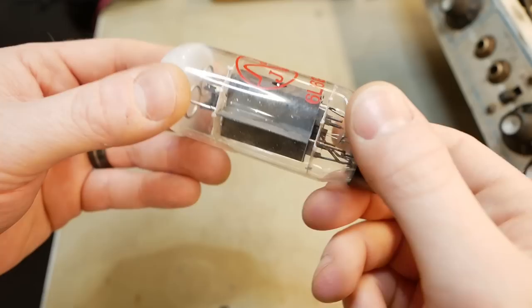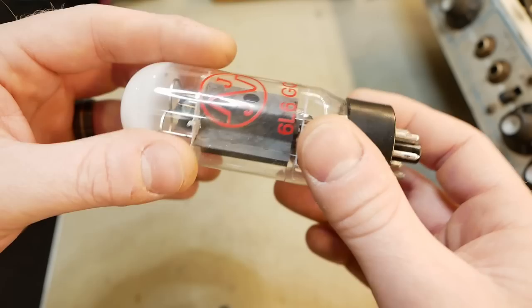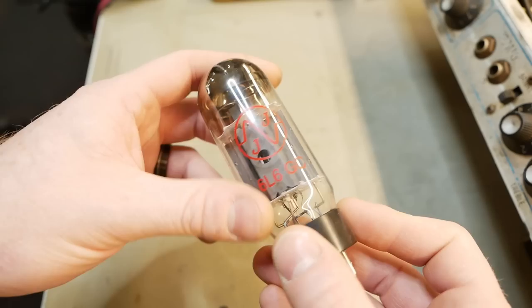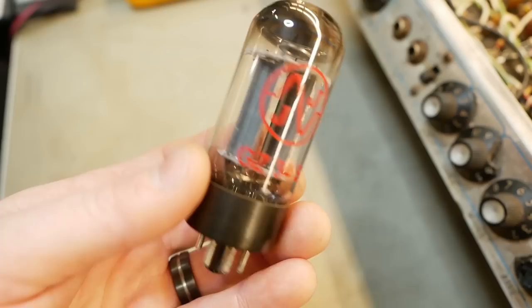When I looked at the rear of the amp when it turned up, the first thing I noticed was the same old JJ's problem. This is too common now to call an anomaly — this is a manufacturing fault, simple as that. Stay away from JJs entirely. Every week something's coming in with a fractured JJ tube. The other one's fine with no real discoloration, so I don't think any valve failures were caused by the amplifier itself — just a failure of that one tube, then being brought in for excessive hum because there's no common mode rejection with only one half of the output stage working.